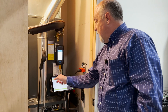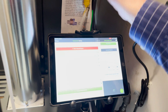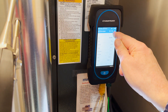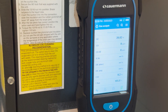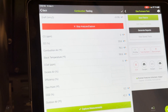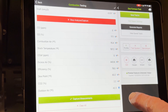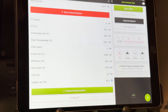I'm going to go ahead and start the analyzer up. When I start it, you'll notice that the pump up here also started. There's a little green symbol telling you the pump is on or off. It's going to take a few seconds for the analyzer to get air all the way through the hose, and then it's going to start making calculations. You can see right here we've got draft already calculating, and our other readings are starting to populate. We'll give this a few minutes to stabilize and get some readings in.